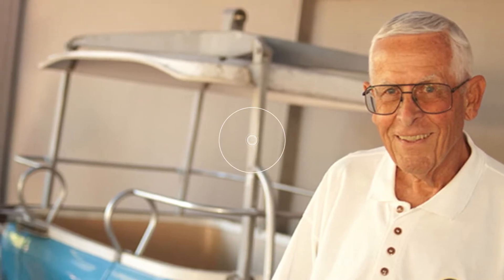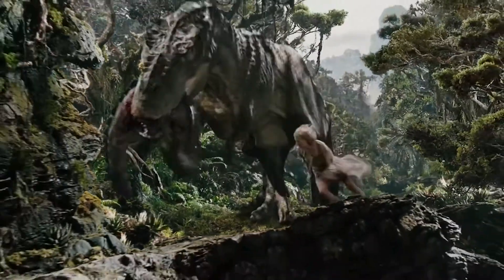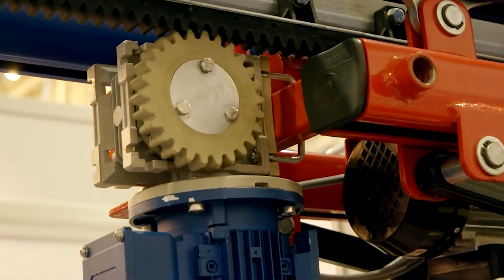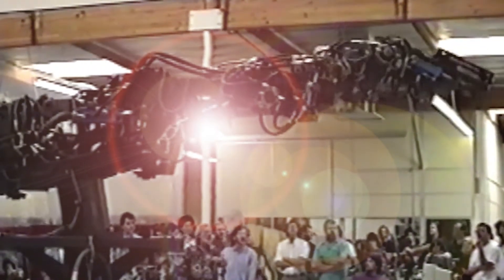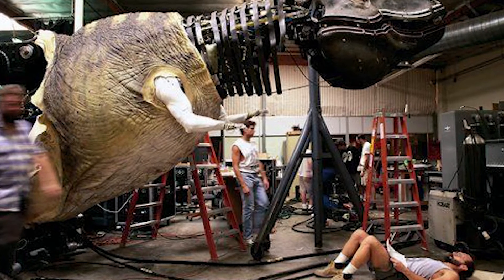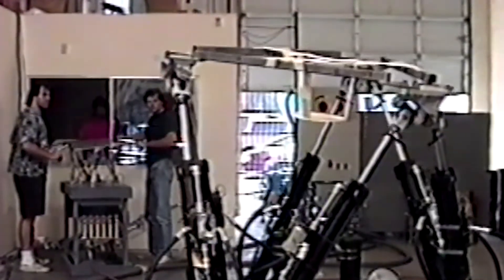The full-scale animatronic was created by Disney Imagineer Bob Gurr, who saw right away that the project would necessitate hydraulics. Stan Winston had hoped to build the full-size Tyrannosaurus as a life-size puppet, but early tests quickly disproved that idea. Stan Winston also planned to employ an electric motor-based system, but the electric motors available in the early 1990s couldn't provide the animatronic with the speed he desired. Stan Winston eventually chose to use hydraulics to fully realize the figure. The animatronic's designs were all made in miniature first to ensure they would work in the larger final animatronic. Richard Landon directed the creation of the tiny concept designs and designed the animatronic's walking rig, which allowed the legs to move independently from the body on a track. The animatronic was created on a main base device based on McFadden Systems designs for flight simulators, custom-built for Stan Winston Studios.